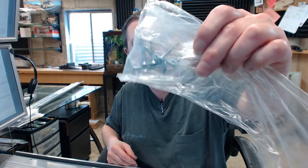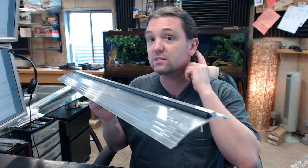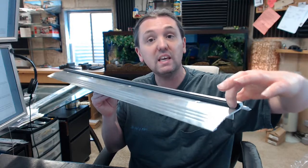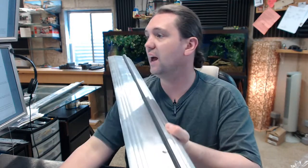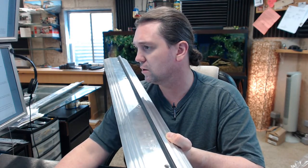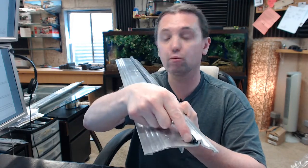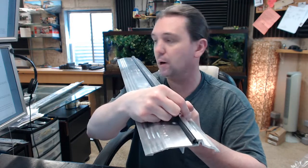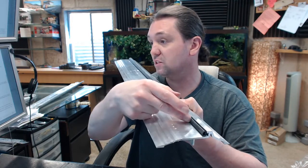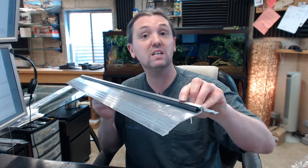And speaking of screws, they are certainly included in a complementary finish. Look like a number 10 by 1.5 inch flathead wood screw. This comes in a dark bronze finish as well. That'd be an 803S, and S, by the way, means silicone. V would be vinyl. I believe you can also get this in N for neoprene. Let's check. This is available in neoprene is N. P is pile, which would be a very small, very short bristle pile. It'd be appropriate to call it, not bristle. And then, of course, S for silicone. So 4 options. Also available in the dark bronze, if I haven't said that, 803S DKB.